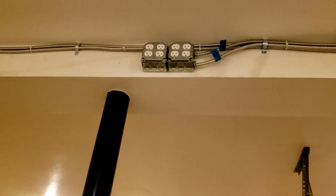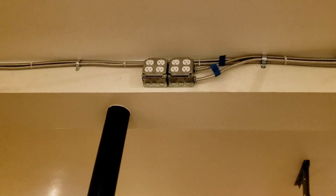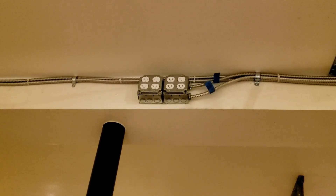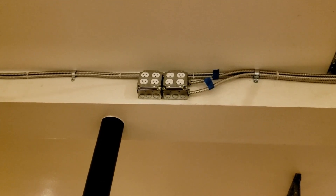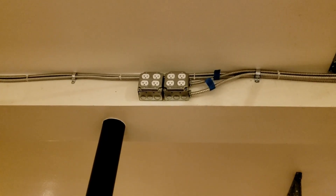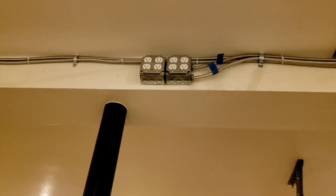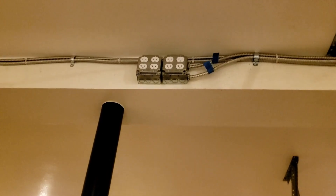The thing I don't like about them though is they take up a lot of space. I would have liked to try those little slip-on rectangular flat ones — I think they would have done a much better job in that sense. When you've got a box with heavy wire and a little extra wire — which you're supposed to have in there in case you ever need to do adjustments or repairs — it gets crowded in there really fast. Trying to push all that in: what a snug fit. I didn't have to take a hammer to it though, so that's a good sign. I was able to get it close enough to the screw holes to draw it in with the screws.